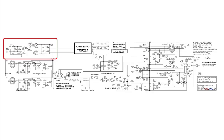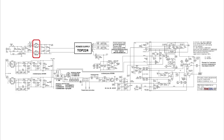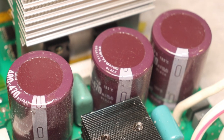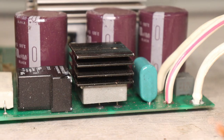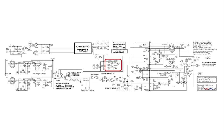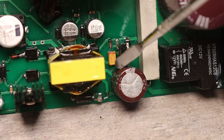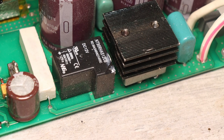Input is at the top left. Nothing unusual — mains power through a filter, which is absent on my board, goes to a bridge rectifier and smoothly charges the input electrolytes through a soft start resistor. When a certain voltage is reached on them, the auxiliary source will work. Next comes the delay in the operation of the relay, and only after a delay of 1 to 1.5 seconds the relay is activated.